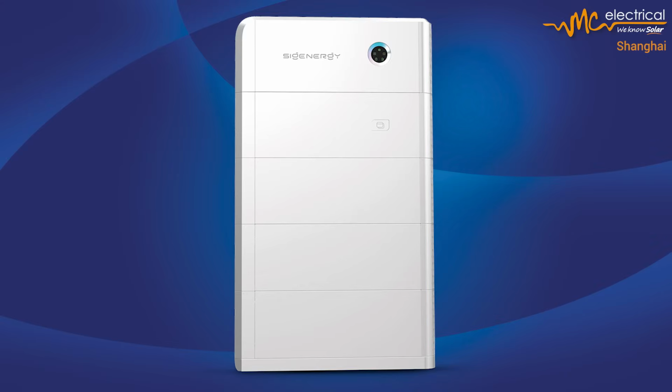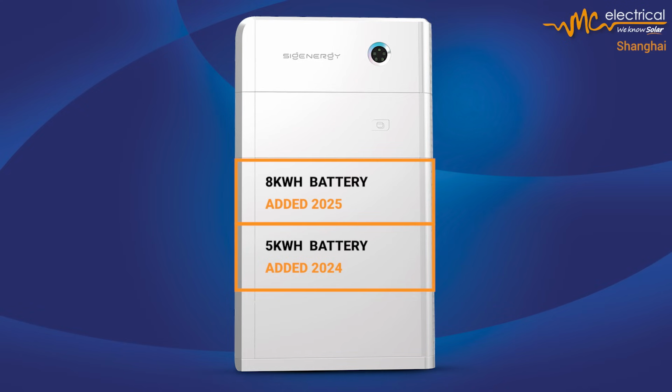Okay, so the first thing, let's just talk about the battery. The battery is only one part of it. What we love about it is that it's modular. Essentially, one of the really cool features about the Sigenergy battery is that you don't have to have an identical battery module if you have a multiple battery stack. You can start off with a 5 kilowatt hour battery module and pair it with an 8. There's talk about having a 10 kilowatt hour module soon. Because of how they integrate those batteries, they're not dependent on a like-for-like setup like a BYD, where all of those modules have to be the same type.